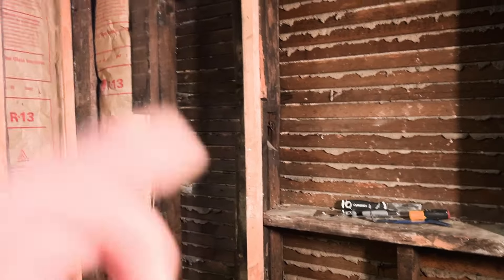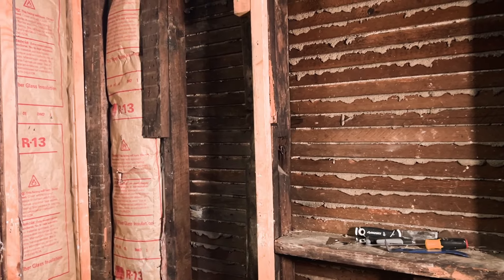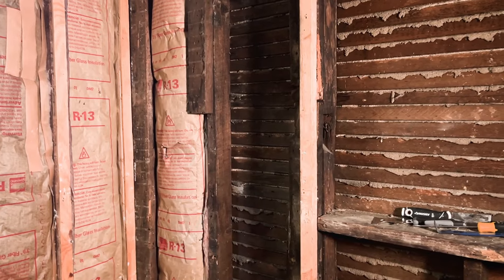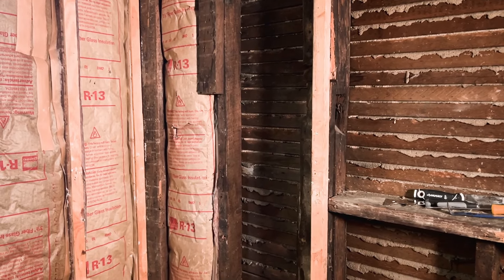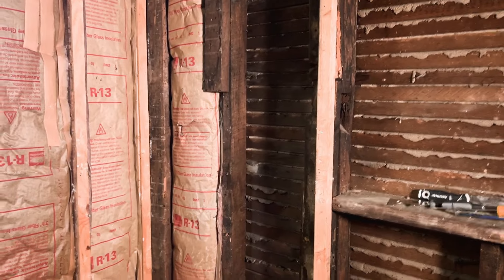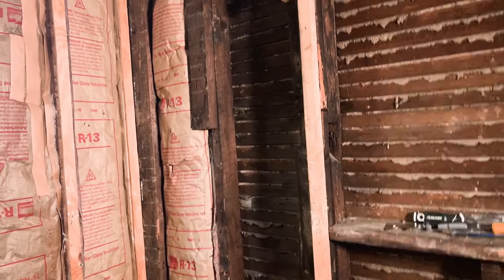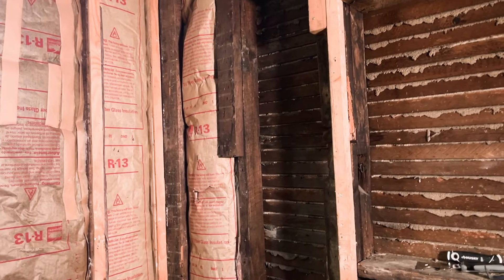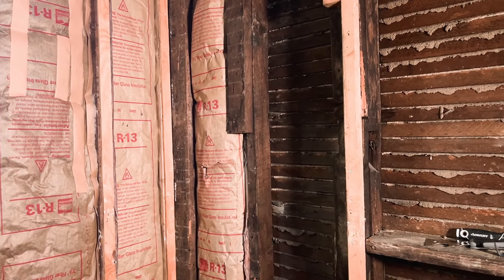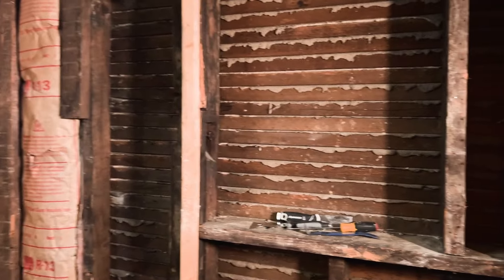The only reason they had that big two-by-two furring going across the entire thing was to get around the circumference of the old cast iron drain. Since I'm replacing that 4-inch pipe — which had huge protuberances at its joints and couplers — with 2-inch PVC for the new vent, I won't need that furring, and I'll gain almost two inches of wall space in this dimension.